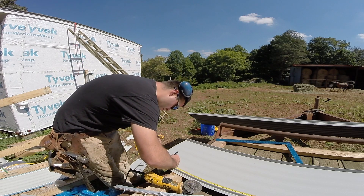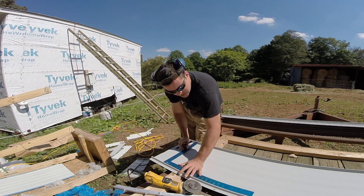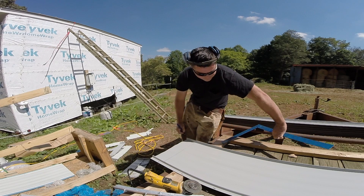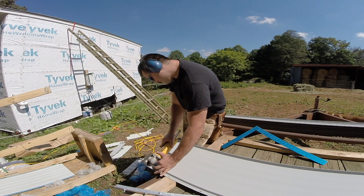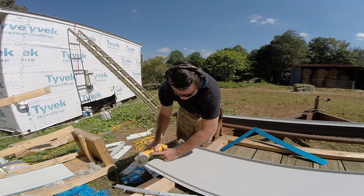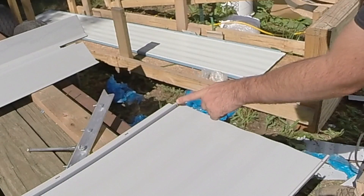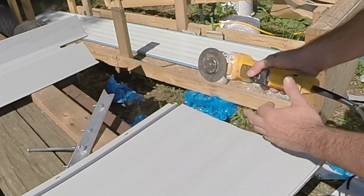I'm going to mark my length, which is 104 inches. My total length is 103, but I need to add for that bend I'm putting in the bottom. I'll take a framing square, place it inside, put it on my mark, and square that across. I'm going to mark one inch on top and one and a quarter inch. I'll flip this around and mark one inch right there. Those are all the marks I need. I'm going to use my angle grinder. Now that it's cut to length, I'm going to cut to the one inch mark, making sure I stop before I get into the corner. I'll put the blade right in that corner and bring it to that mark. I noticed when installing that this piece causes a problem, so that inch and a quarter mark — I'm going to cut down on an angle to this point right here.